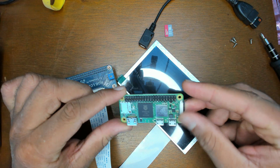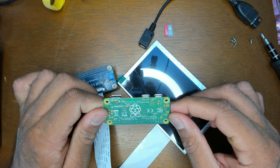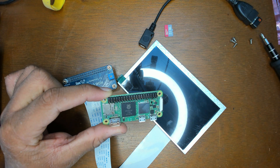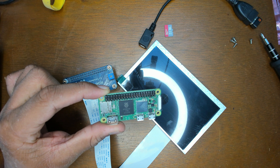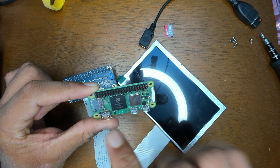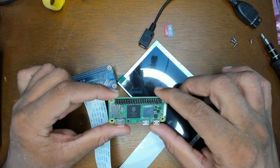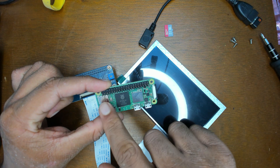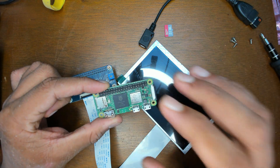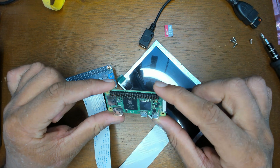All Raspberry Pis have the GPIO header, and what I wasn't as familiar with is that all the GPIO pins have an alternative function for RGB24, RGB666, or RGB565 — a parallel display interface spec. This one uses the RGB24 parallel display interface, and with a device tree overlay you can convert all of these pins to a display port. The downside is it consumes all of your GPIOs. But you're not using any chips or any HDMI-to-XYZ conversion — this comes directly out of the Raspberry Pi.